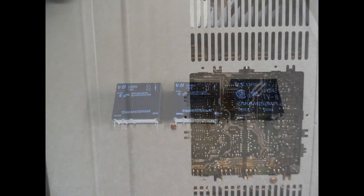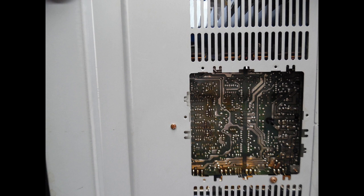The video also shows the service access hatch. You can remove the screws for it, but it doesn't give full access to the whole board, and some dry solder joints won't be reachable from the hatch. There's also quite a lot of flux from manufacture, so use a flux remover — spray it onto the board after reflowing to remove all residual flux, leaving the board in pristine condition.